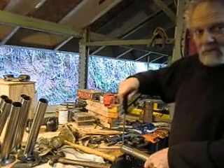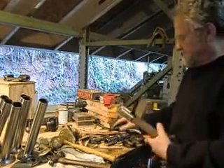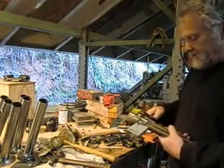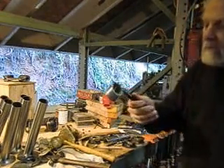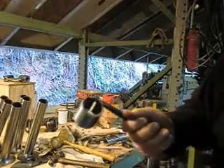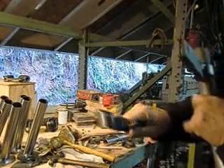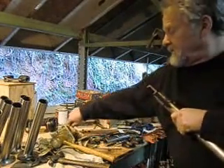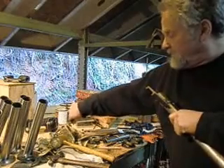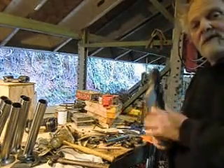The screw is really the only thing that holds the piece in place, because otherwise the grinder would just throw it off the tube. The interior is cut and it's spread — it's ready to have the washer welded on top, and that'll be the next step. We're going to do 15 or 16 more of these first, and then we'll get to that next step probably tomorrow.